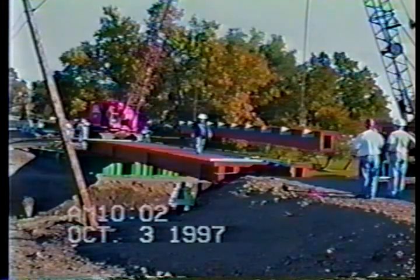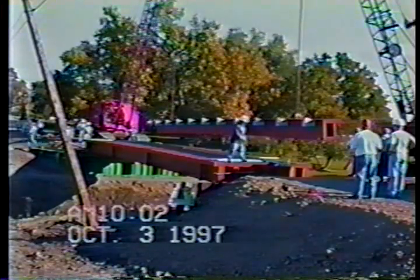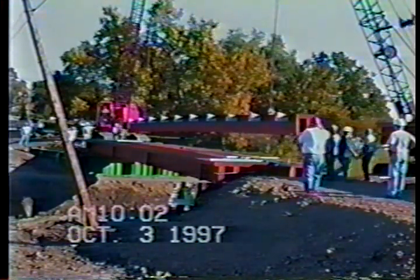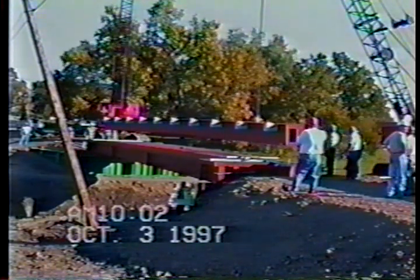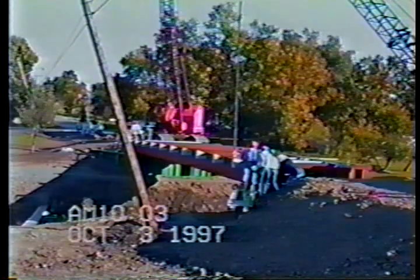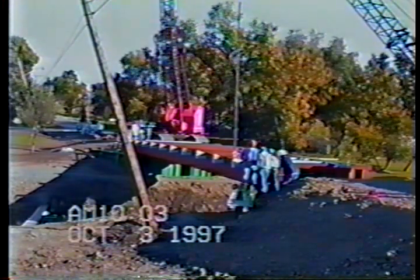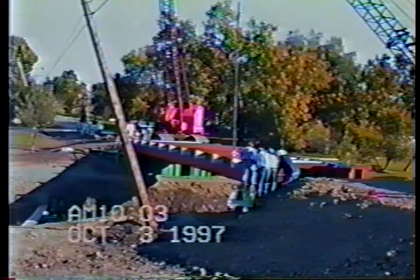Once the first beam is fastened down, the T's are placed outward in one direction until the exterior box beam is set. The box shape is used for extra longitudinal stiffness and to facilitate attachment of railing systems. These box beams have the steel shoes for a PL-1 crash tested railing assembly already installed, similar to the one tested by the University of Nebraska-Lincoln.